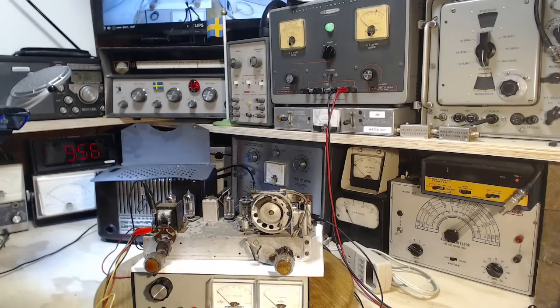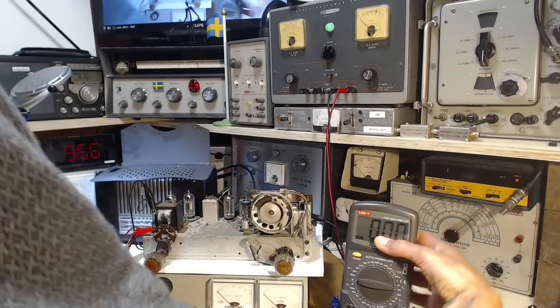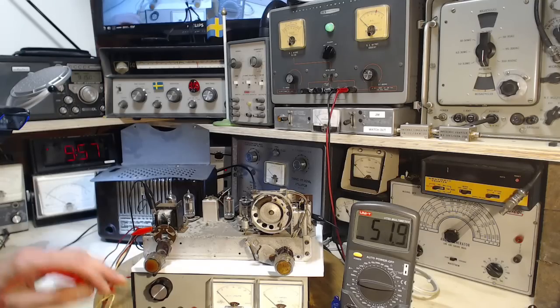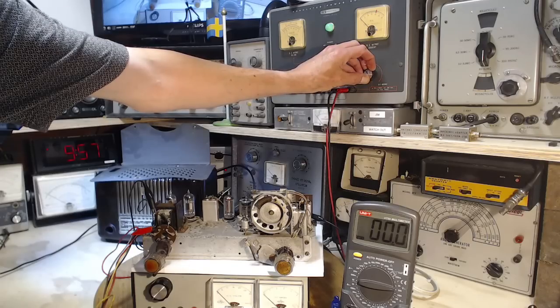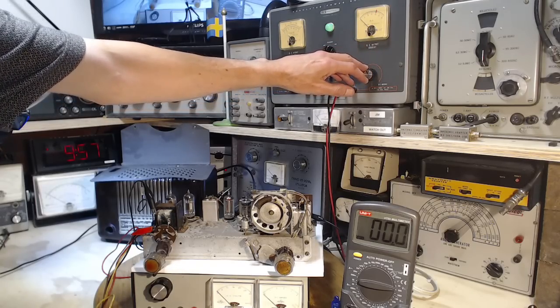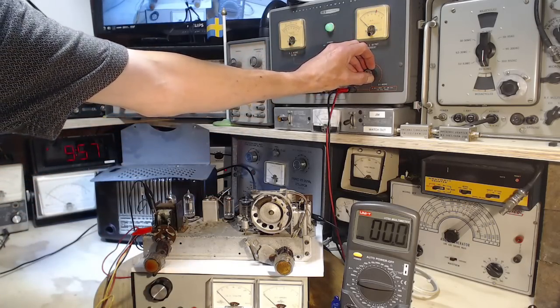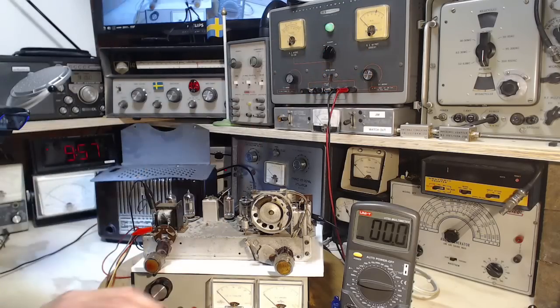Touch higher. Let's check it. See where we really are. Where are you really, Jim? Volts, and about 60 on this meter here. Let's go a little higher. The battery operated radio, you expect very little leakage in the high voltage when the tubes are not lit. So we're only at 70 volts still. Now this meter's come up a little wee bit. Get her up a little higher yet.